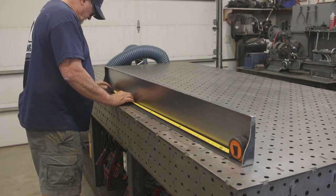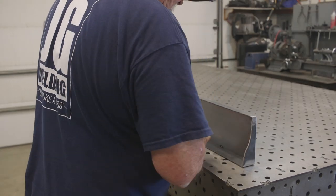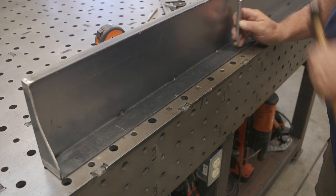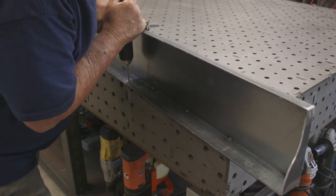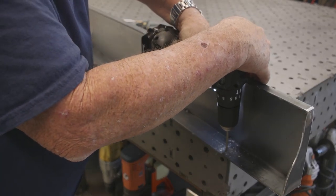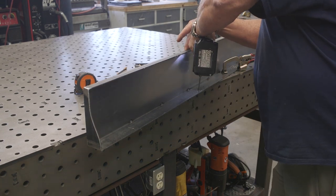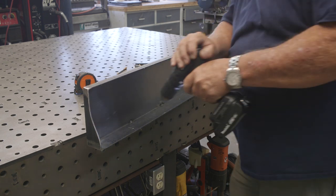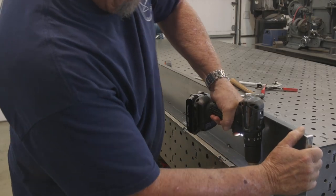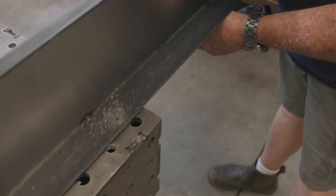Before painting I thought it'd be a great idea to get some mounting holes in here. The shelf is five feet wide, so I'm coming in six inches from either end and then marking every 16 inches on center — most houses have stud spacing of about 16 inches on center. Hopefully when I mount this shelf I'll be able to hit the studs, though it doesn't always work that way. I'm going to use two inch drywall screws — the shelf will be painted black and the drywall screws are black too. I'll recess them in with a countersink so those screws sit in there really nicely.